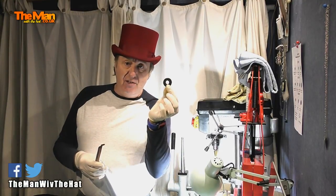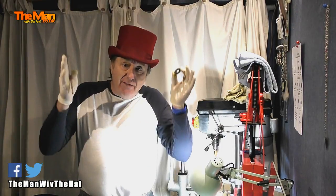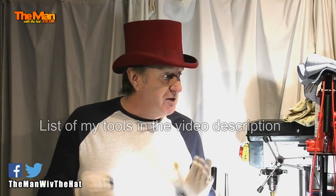Video number one, if you missed it, was about finding dead centre and making a hole in a coin within millimetre perfection — it has to be as close as possible, otherwise you'll get an uneven ring. This video is about folding the coin — that first fold to get the initial shape to start putting it onto your ring mandrel or whatever you're going to use. I'll be using a set of dies, punches, and presses. You don't have to spend the sort of money I've spent on equipment. I've decided to take this very seriously over the last few weeks, and I'm amazed at the response — worldwide.